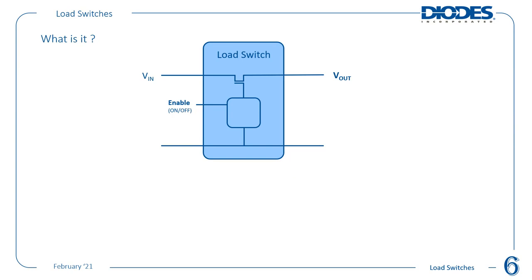So what actually is a power switch? You have a VIN, you want to get a VOUT, and you want to just enable it on and off — that's a straightforward power switch; it doesn't do anything more than that. The easiest way is with a P-channel on the high side and an N-channel. But if you want to add more features, you need to go for a load switch with an N-channel on the high side integrated with a charge pump. The N-channel allows lower RDS-on for higher current throughput.